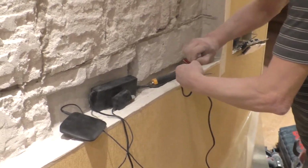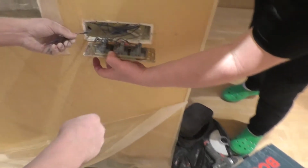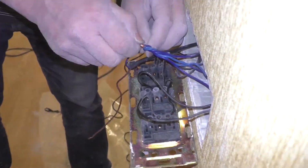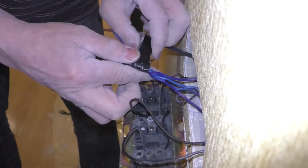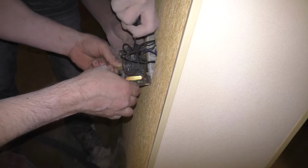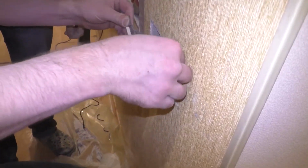Since we connect to the wiring directly, we had to cut out both plugs from the wires of the TV and the Xiaomi Mi box. Please know that the smart box is powered by a 12-volt adapter which must be saved. Connect the power of the TV and the smart box to the phase of the switch and zero twist. Please do not repeat this operation without any appropriate skills, so contacting qualified electricians would be the best decision.